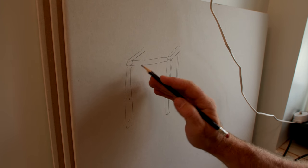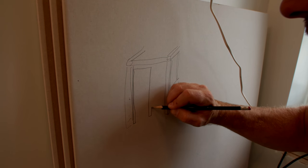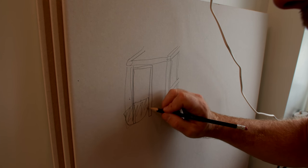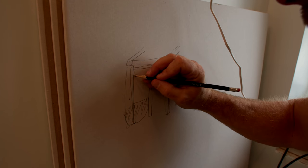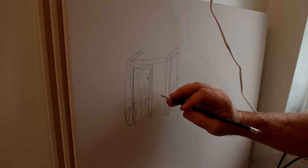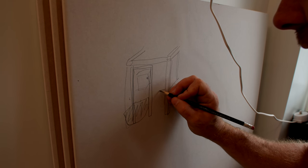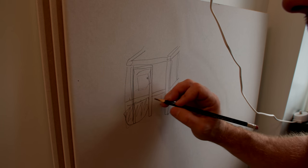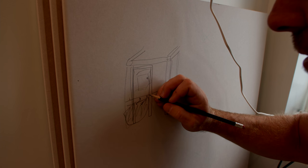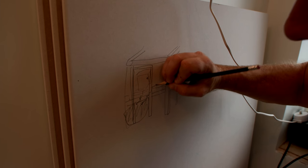The thing we need to do is know for a fact that our metal frame is gonna be shrouded in this bit. Our metal frame will be here because it's slightly offset, and the centre of our toilet is gonna be about there. Our button is gonna be up here, and behind this we will support our cistern so we know it's gonna be able to support that. We also have to think about the fact that our toilet is gonna need proper supporting at the back, and so is our frame. So we are gonna have to tie in pieces of timber across the back here, but also there are some screws that go into the back of the toilet that have a plate on them that usually would go into the back wall. So we're gonna need a piece of wood that runs across the back that will take those screws.